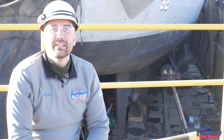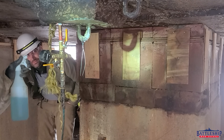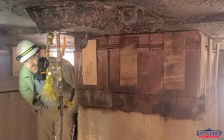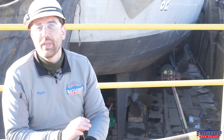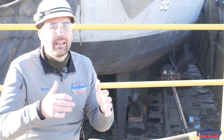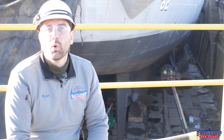Another project we've been working on is testing the through-hull blanks. The original navy fittings aren't good anymore, so we're drilling and tapping for new nipples to attach the compressed air line to, and that is limiting us to about five blanks per day. So far about half of the blanks have failed the air test. However, when we've soap tested them there haven't been any bubbles, which means the air is not leaking out of the blank — it's leaking out of the 80-year-old valve inside the ship that hasn't been maintained in 30 or 40 years, so that is not a concern at all. The fact that the blanks have all held so far, except for the one we knew wouldn't, is great. Because we're only doing five a day, it's going to take us most of the project to work through all of them.